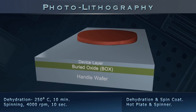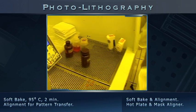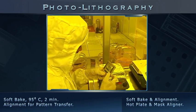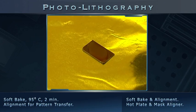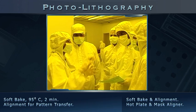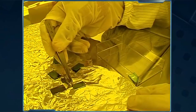In a 3D model, we see that the photoresist layer covers the entire device layer in even thickness. The resist-coated samples are then moved for soft baking at 95 degrees Celsius to evaporate the solvents in the photoresist. Soft baking ensures the resist will not stick to the glass mask during the next step. The entire batch of wafers is processed in the same way.